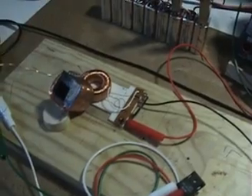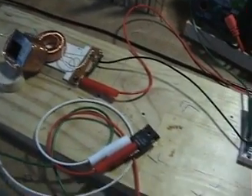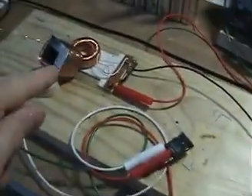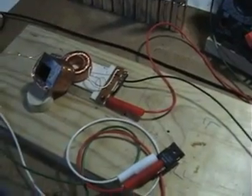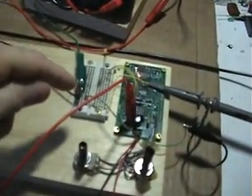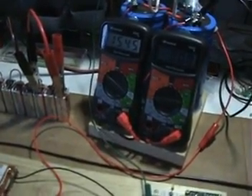People who are very knowledgeable in electronics have been making comments that the coil is probably not even pulsing — it's just the generator charging back the capacitors. But that's not true, because when I start this circuit, this secondary coil pickup could not sustain the circuit if the MOSFET wasn't obviously pulsing that coil. So that coil is being pulsed. That secondary is picking up enough energy to continuously feed the MOSFET. But unfortunately, I can't disconnect the battery clip because there is current being used.